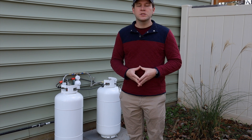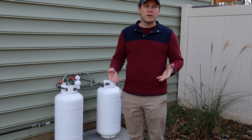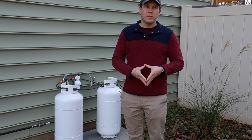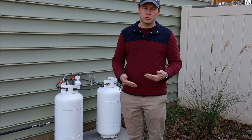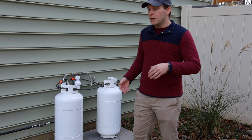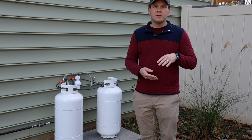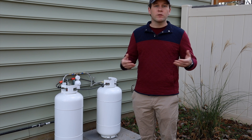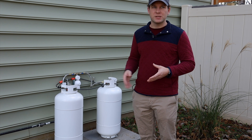We've gone with a high-flow hose capable of 140,000 BTUs. We didn't need anywhere near this, but these have safety shutoffs for leak protection and a lot of other features. We didn't want to risk accidentally triggering those safety shutoffs with a lower-capacity hose. If you're concerned about selection, the customer service with Marshall Excelsior and some RV stores is generally very helpful and can advise you, as can a lot of plumbers who deal specifically in gas.